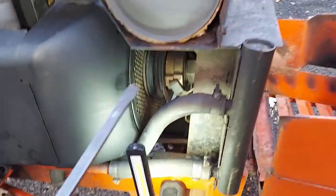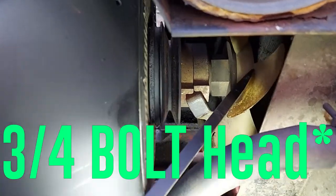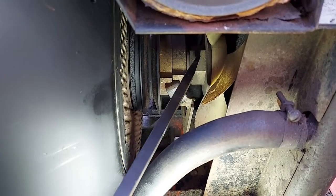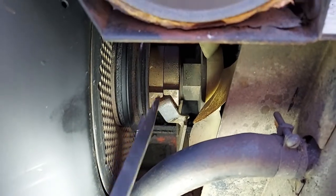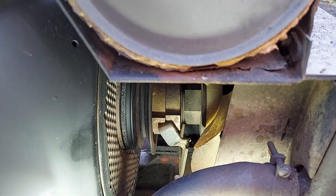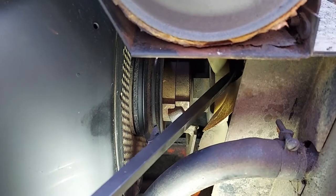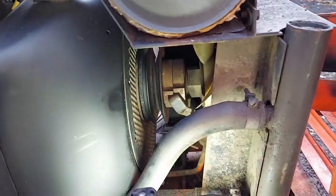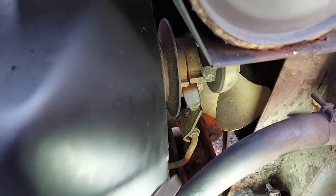In here you've got your big nut and your adjusting nut. There's a nut in the front of the fan that you can't see — that's your tightening hex nut. This here is your adjusting nut, and you want to spin it clockwise when facing the front of the tractor to tighten up the gap. The inch and three-quarter wrench is for the adjusting nut; the three-quarter inch wrench is for the front hex nut that locks everything in at the end.